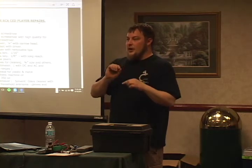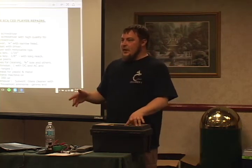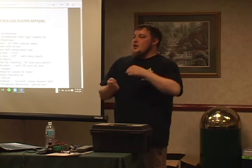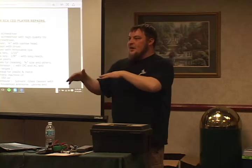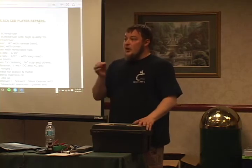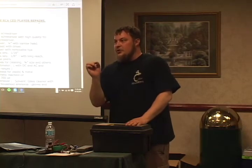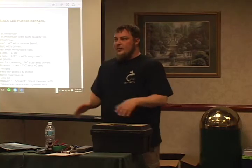Then when you know you don't hear it, you keep playing the Star Wars disc and you play it all the way to at least 55 minutes. Because the way turntables are, they can change when you get to the outer part, because of the way it plays the disc. If it needs adjustment, you do it. But if it's playing fine at 55 minutes, it's playing fine at 1 minute, your height's fine. You can obviously adjust it anyway. If you get to that 55 and it's not playing right, you adjust it a little to get less fuzzy or less choppy, because they do weird stuff when it's not the right height.